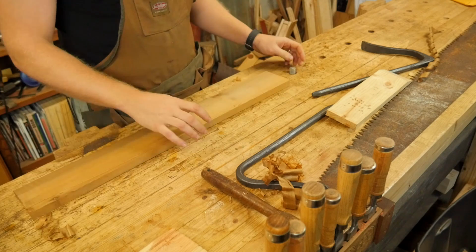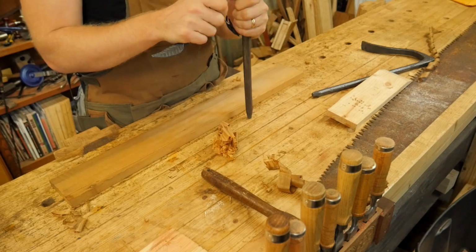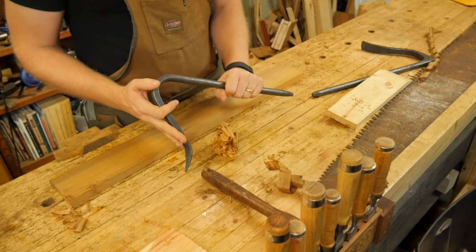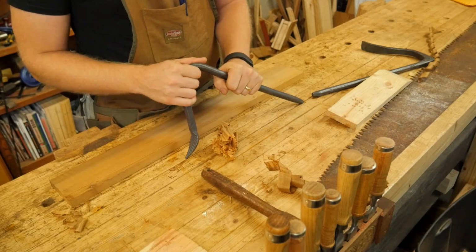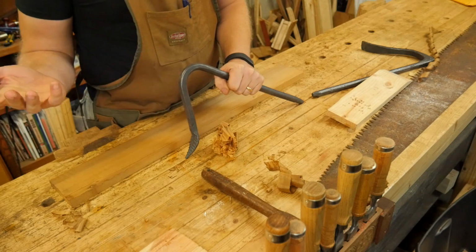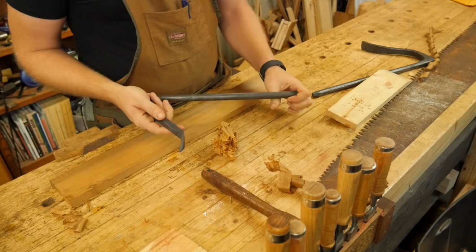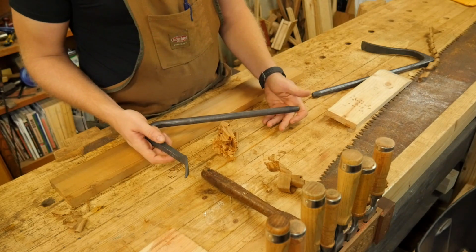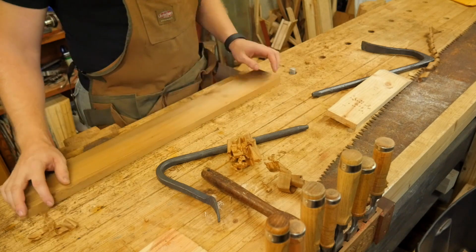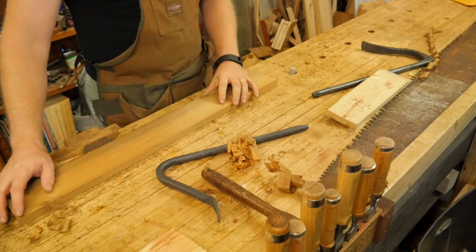But for my money, a Holdfast is probably the cheapest way to hold work to a bench. I mean, the price of most vises, you're running $60, $70, $80, $100, $200, $300 for the good ones. Whereas with a Holdfast, the really expensive ones aren't going to get you anywhere near the price of a solid vise. Whereas if you just want to try with stops, all you need is a dog, and you can make one of those out of a piece of wood.